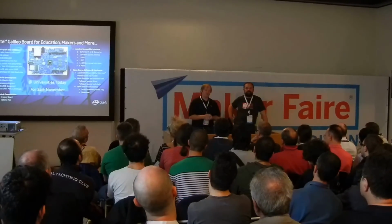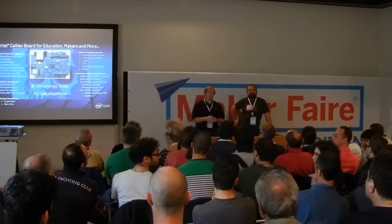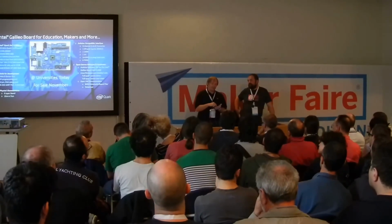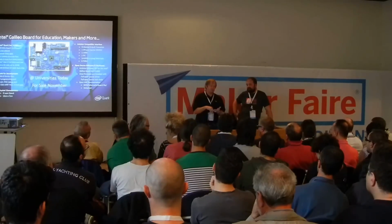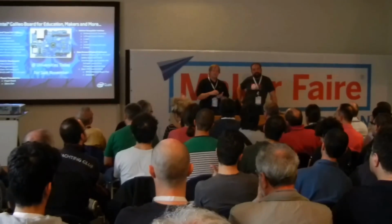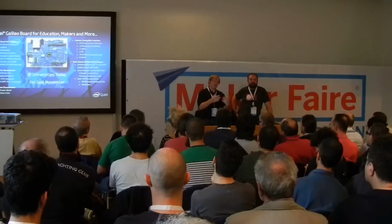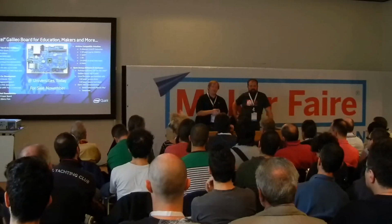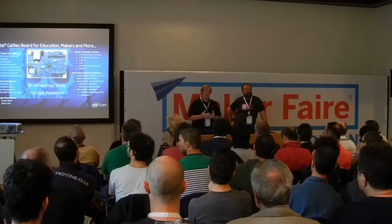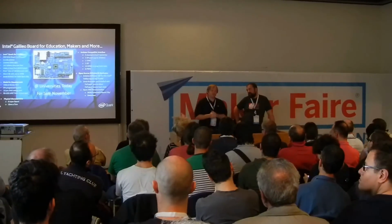From that point of view, you just have to set the right switches. So you can cross compile easily, yes, you compile for 586. You'll have binary compatibility at the application level. Obviously, depending on the hardware you have, it might be different. But if you compile it for the Quark, it will run on an Atom or a full Core, which is another great feature. Now if you compile it for those, it won't work on Quark because it doesn't have all of the switches set right, and at some point you'll get an instruction that it doesn't understand. I think from a bigger point of view, that's kind of an exciting play: you can start on the Quark and port your applications from there.